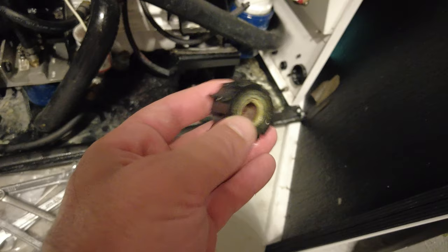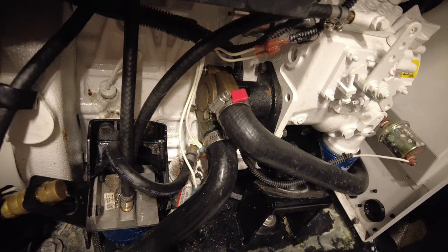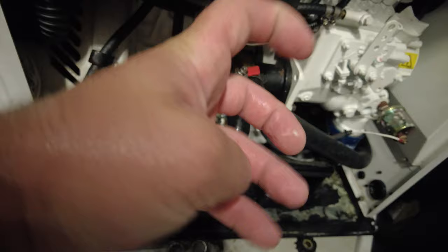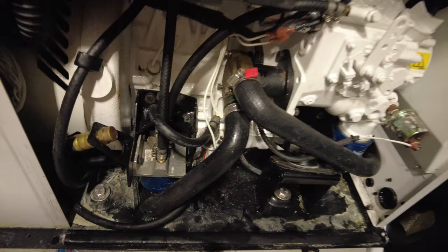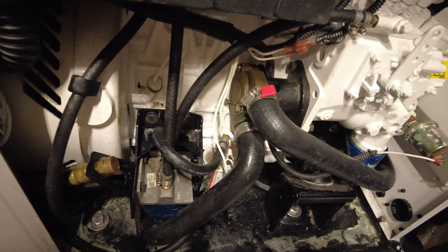But what I'm not entirely certain about is the direction that the teeth bend in. I noticed the last time I did it, I didn't hear as much water passing through the impeller. So I'm going to try the opposite direction. So when I mean the opposite direction, rather than the teeth turning that way on the impeller, this time I'm turning them the other way. And hope that's going to work. So we'll see. Otherwise I've got to do it all again, but I'm not sure that I've got a spare impeller. I might be really lucky and look through my supplies and see what I've got.